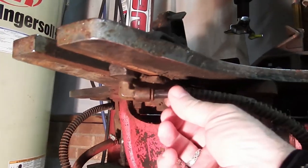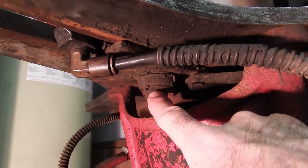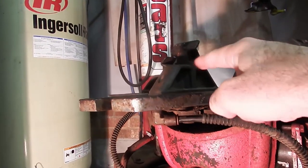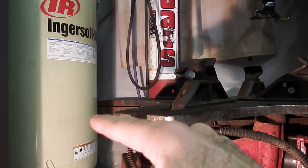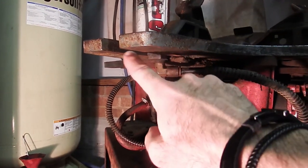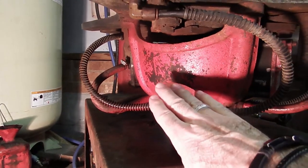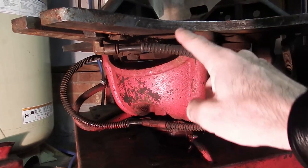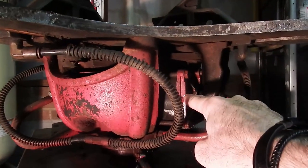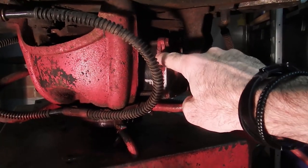There's no fitting — you just unscrew this from there. The plan is to remove the four bolts that hold the clamps, and once I do that I have enough room to slide the clamp off and just lay it down. Or I can spin this off of that if I need to. That's part two. Part one is getting this out of the way, which will give me access to the cylinder. Then I can take these two lines off, one on each end, pull this off, and go ahead and rebuild it.